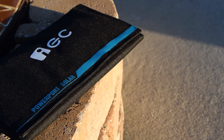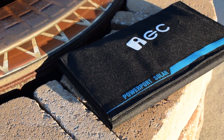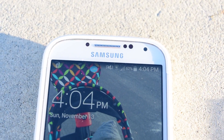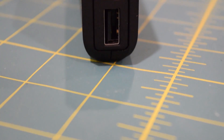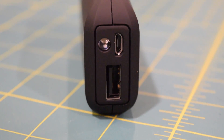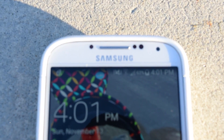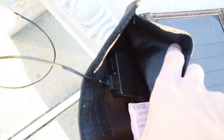With regards to the battery bank, I thought it would work as a pass-through — that you could charge the battery bank and charge a device at the same time — but you cannot. I tried that and my phone wasn't charging, which led me to discover that this thing cannot charge a device and be charged simultaneously. A lot of other battery banks on the market are the same way. I did plug my Samsung Galaxy S4 directly into the solar charger with no problem — it charged my phone just fine. So this thing does work; if you take it out into the field and put it down, it will charge a device.